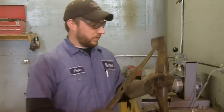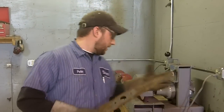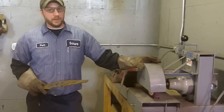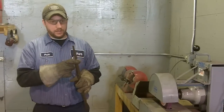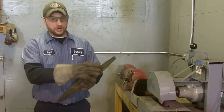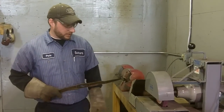So with the Honda lawnmower blades, you have two blades. You want to do each blade one at a time. Today I'm using an RBG blade grinder. And what you want to do is sharpen the angled side of the blade and use your flat edge to keep your guide. So what I'll do is I'll set it up.